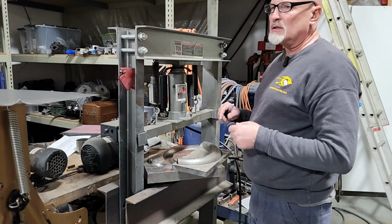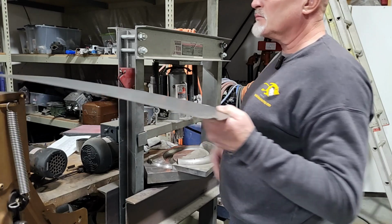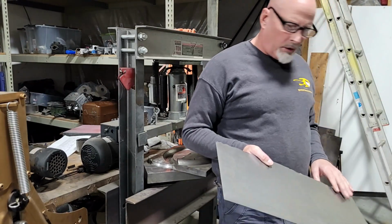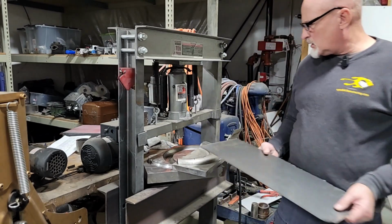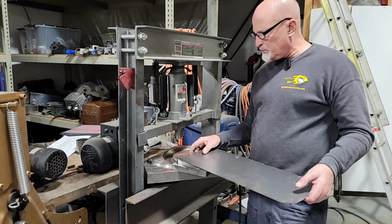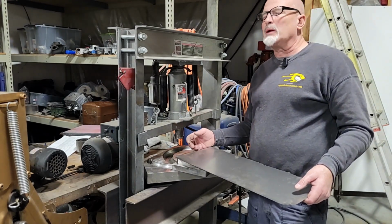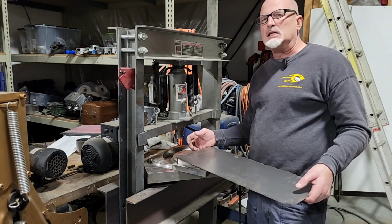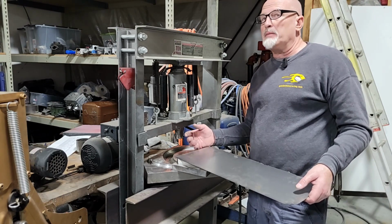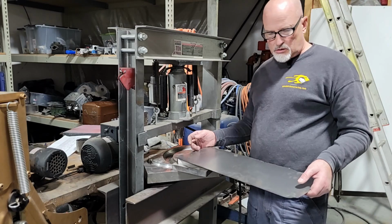You know, I've never used mild steel for header material for doing a pipe. I've always used stainless because I run at the salt. And stainless is such a pain in the ass to work with. It makes a great pipe, and the salt doesn't corrode the shit out of them. So I guess there are some benefits.